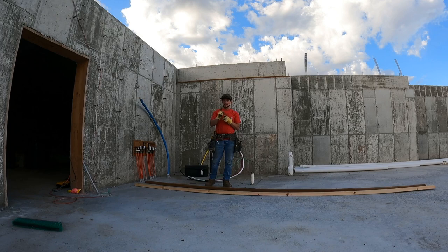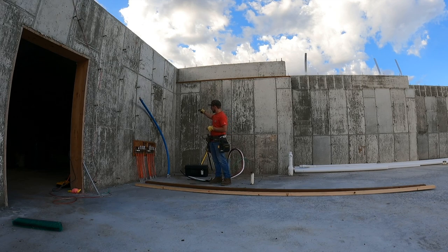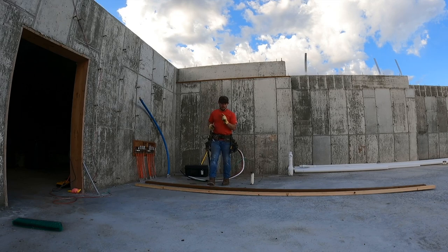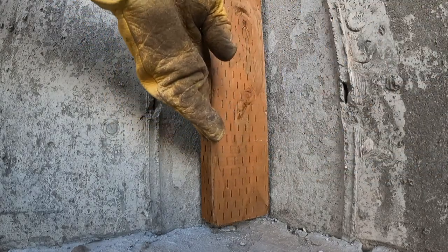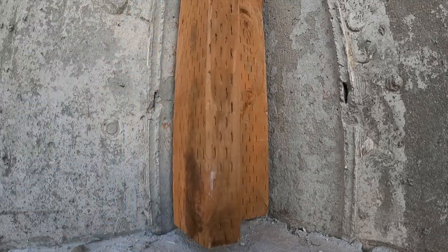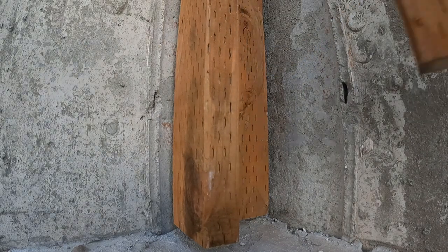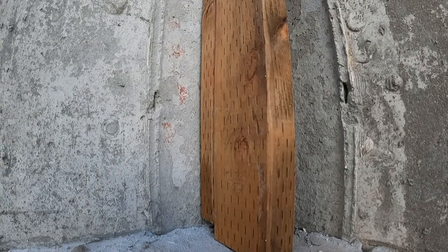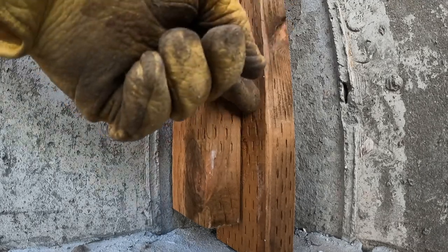The only thing we've got to take into account is we need a nailer because we're putting the two by four behind this wall, which is technically the first wall. We need a nailer so the sheetrock can line up with it. We bring in our first wall going this direction, but then when we bring in a wall going the other direction, it sits against it. The two walls can be nailed together, but sheetrock has nothing to nail to there. So you have to do what you call a California corner.